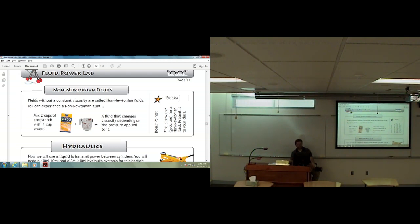Water causes corrosion with most metals, mostly because it easily transfers oxygen to the metals, so the metals oxidize. They rust, or aluminum oxidizes and copper oxidizes, and all these metals that we use oxidize. So it's not a great idea to use water in an environment where oxidation is bad. Oils, however, do the exact opposite. They have a tendency to protect metals from oxidation, and they have lubrication. So the ideal fluid for a hydraulic system is actually a very thin oil that can handle a lot of heat, because you get a lot of heat as you pump it through the system and as it goes through these cycles.